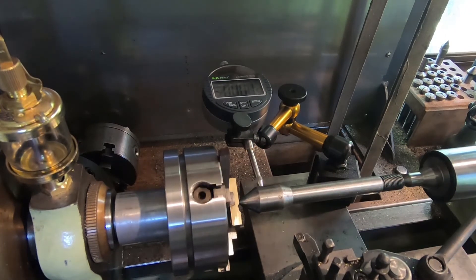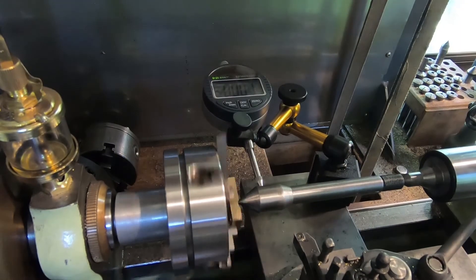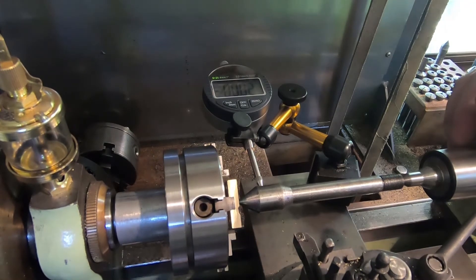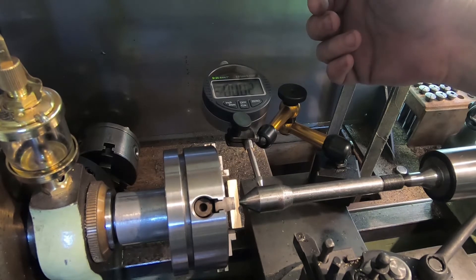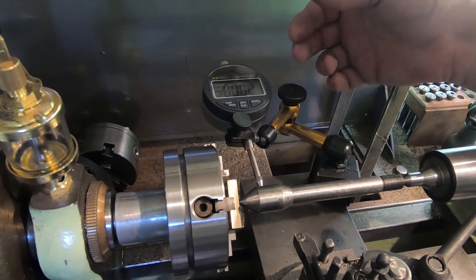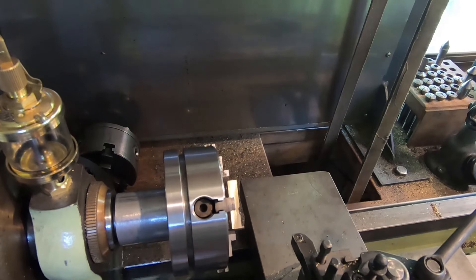So that's pretty straightforward. To set that up — for the second one I've just put a piece of high speed steel in there as a spacer because I haven't got a parallel about the right size. Anyone watching this might realise that parallels of all sizes are useful — it's easy to discount them thinking 'I don't think I'd ever use those.' But any particular size and shape of parallel are useful for something, and you should, if you get a matched pair of them, hang on to them because they're pretty nice to have. Anyway, that's set up within a thou, no problems at all.